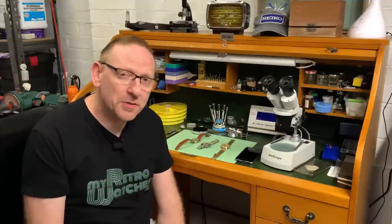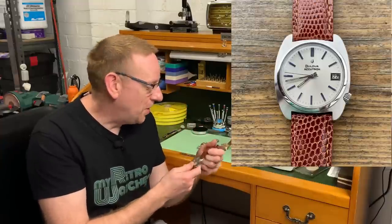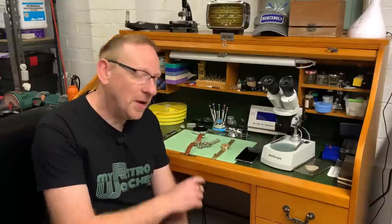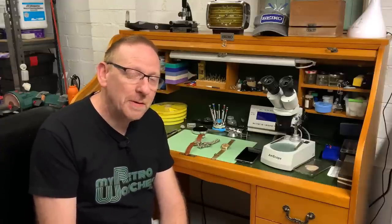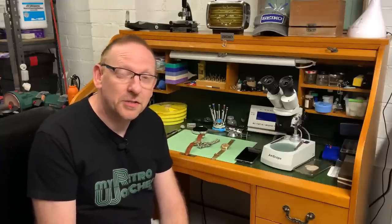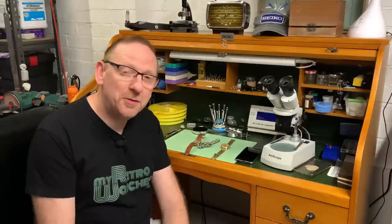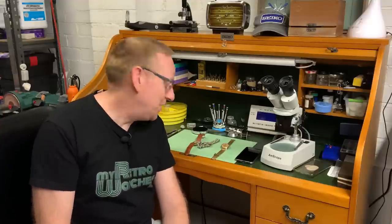A regular subscriber and friend of mine — a guy called Pete Hurst — did a trade with me. I fixed some watches for him and in return he gave me this Bulova 218, but it wasn't working. I tried to fix it on numerous occasions without much luck. Then less than a month ago I decided to come back to it, stripped the dial side down, and realized there was a lot of dirt around the centre wheel. I cleaned it all and lo and behold it ran — I was absolutely gobsmacked.